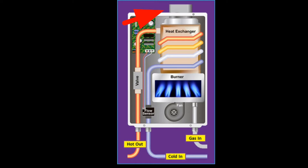Cold water replaces the hot water at the bottom, based on the fact that warm water rises. When the tank water temperature drops below the thermostat set point, the water heater burner runs until the temperature recovers to the set point.